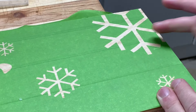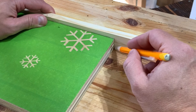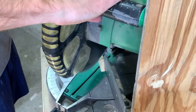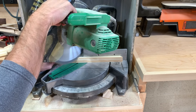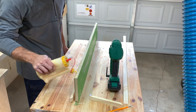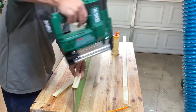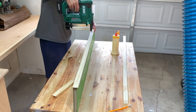I came back through and pulled off all of the negatives to reveal the stencil. Then I took the strips I cut earlier and measured those out on the actual piece to get the frame — I didn't use a tape measure for this, just held the piece up and marked it. I cut all these pieces on the miter saw and started to attach them to the stocking hanger. I used a little bit of glue and some 18-gauge 1-inch brads to hold it all in place. The frame is 1-inch thick, and since the plywood is three-quarters-inch thick, it's got a little quarter-inch reveal or overhang.